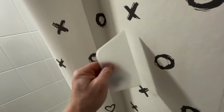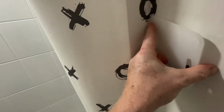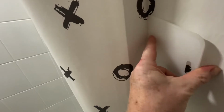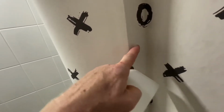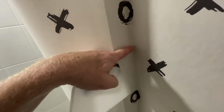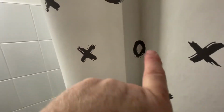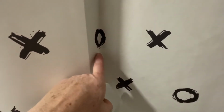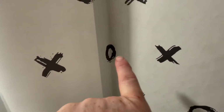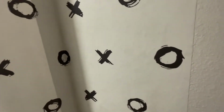Do you understand that? The determination will be made by putting my smoother against the wall and cutting here, so that this edge, after I cut it, will be underneath this sheet, and this paper will be moved toward the corner to tuck the edge of this piece underneath this one, so you don't see the edge of this piece right here looking at you if you do it the wrong way. Okay, let me cut it for you.